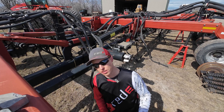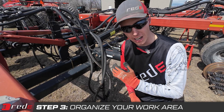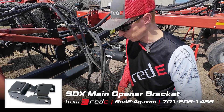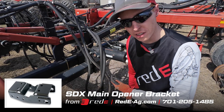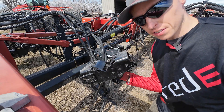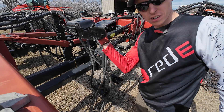One of the first steps that I've always learned that is most efficient is think of a production line. You want to have everything laid out so you're doing fewer categories of tasks. You don't want to have to reach for a drill every time, reach for a nut — it would make no sense to do that and maintain efficiency. So what I'm going to do is lay everything out first all across this width of the machine. Even the direction you put these down makes a difference in how fast they go together. I'd recommend putting them on the ground like so, so that it's easy to reach your hand under there, lift them up, and go right into place.